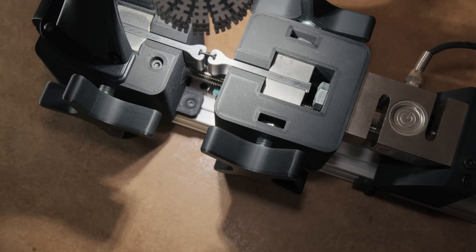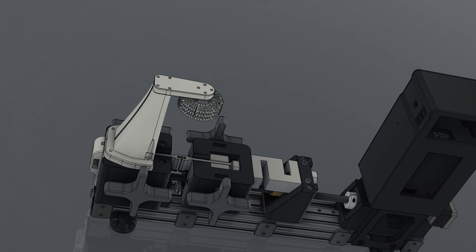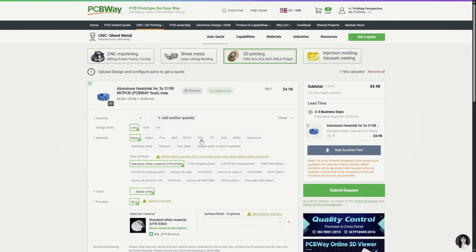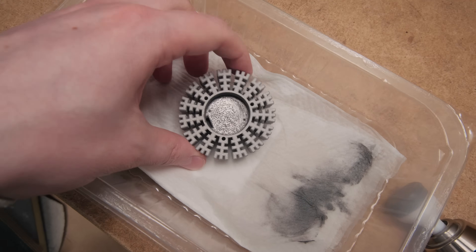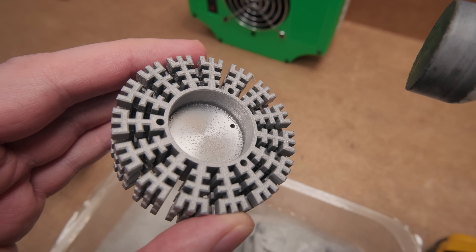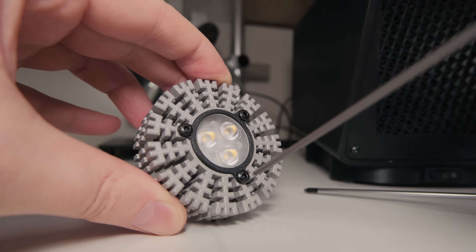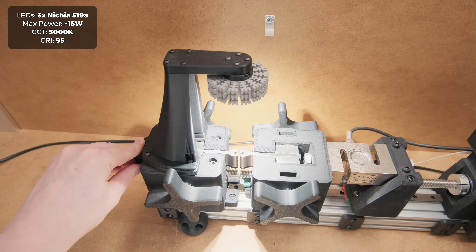So to improve my experience when using the machine and filming for video, I designed an integrated lighting solution. It uses a high-efficiency, passively cooled heatsink design that was 3D printed from aluminum using today's video sponsor PCBWay manufacturing services. Unlike CNC machining, 3D printing from metal leaves a grainy texture on the prints, which means it might require some post-processing. In this case I had to sand flush the spot where the MCPCB of LEDs will be mounted and make the threads for the screws. The design uses parts for a flashlight and the final look is a beautifully diffused, high CRI lighting with a simple and convenient control.